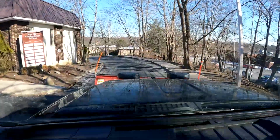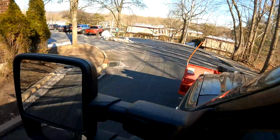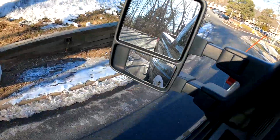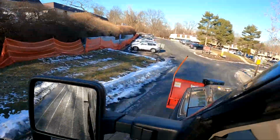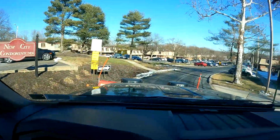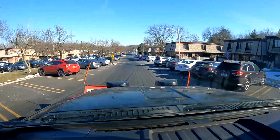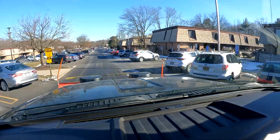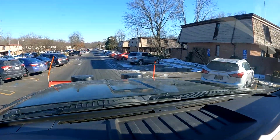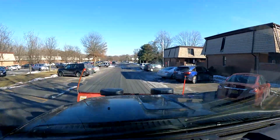But as you can see, there are lines everywhere. So I did 2 passes in each direction, and then I did these crossovers. There's 3, maybe 4. I think 3 of the crossovers. But as you can see, our lines are, well, they're wet obviously still, but they're black. So that's how they'll dry, and then once the snow comes, or the ice, whatever, and you hit it with some salt, it should activate all this stuff and really help you with melting everything.